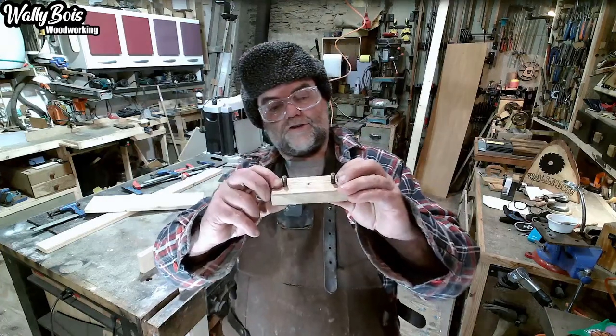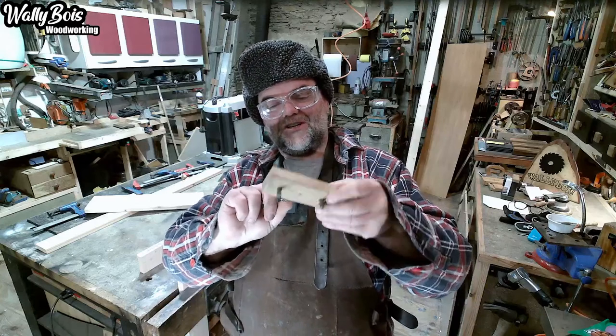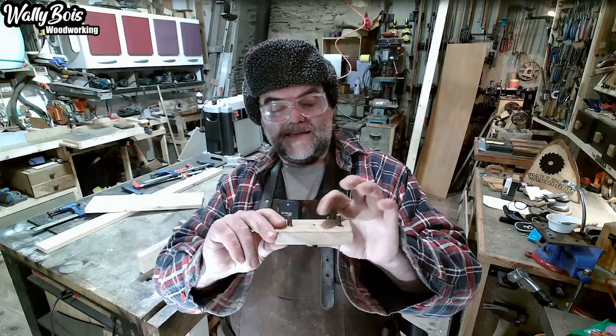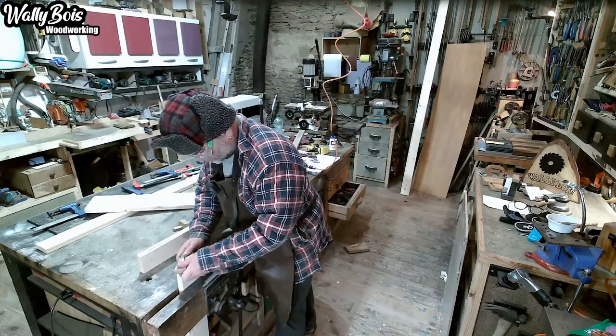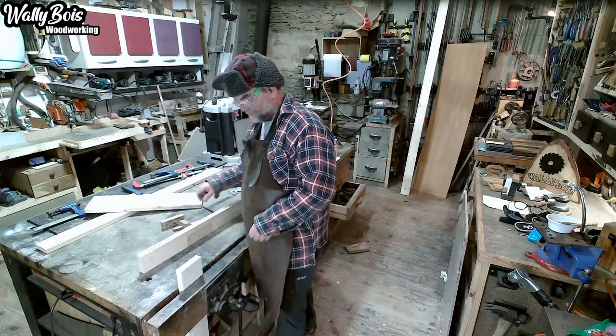And I made it as a block of wood, and it's got two sawn-off nails, and a little bugle head plasterboard screw just poking through to create the point, and that is dead in the center of those two bits of metal, those two sawn-offs. And then we just mount that on there like so, and we just drag that forward like so, and that'll mark the center for you.